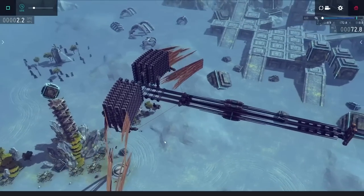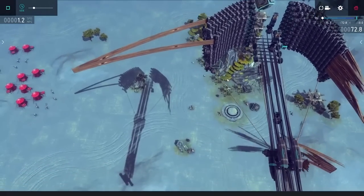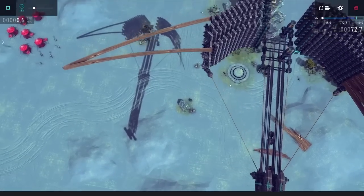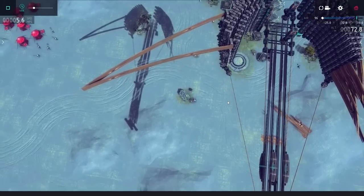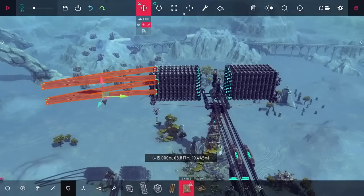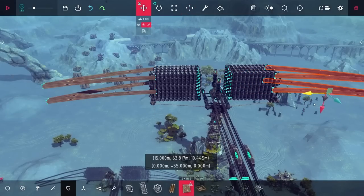Making them a lot shorter did help, but you'll notice that the angle of the arm is now completely wrong. That was because I accidentally linked the two ends of the arms together, and by doing that it prevents them from rotating at all. After unlinking those, I copied this to the other side and wanted to try giving this a test. This was actually working, but I didn't really like how loose these arms were and just how bad they were deflecting away from each other.